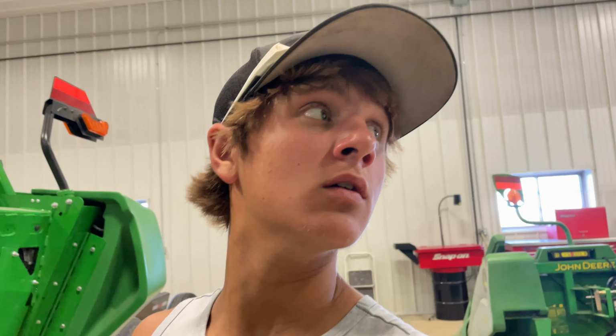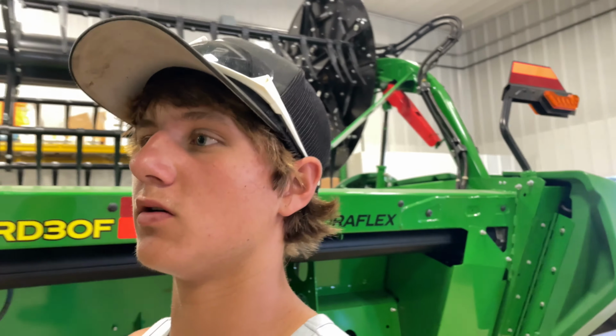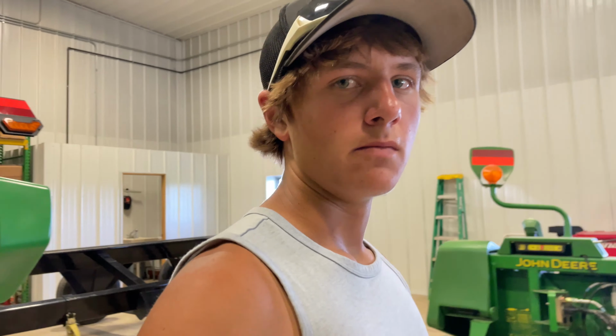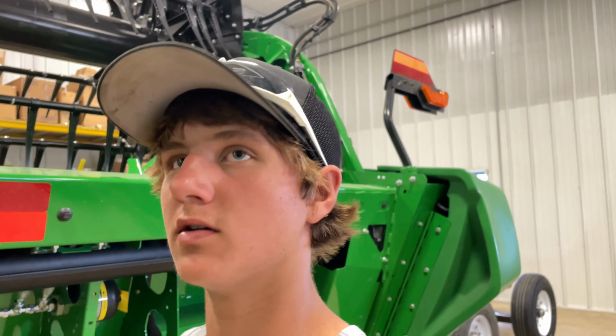And over the weekend, it's Monday now, but over the weekend we did all kinds of work to this. I know I'm filming the video of me changing the oil on it, but basically all we do is check all the belts, make sure they're not cracked or anything, change all the fuel filters, and then every 2 years we change the hydraulic filters. We actually ended up doing that this year. And then we ended up changing every single filter in this combine, all the cab filters, all the air filters, engine air filters, everything like that. And so yeah, that's all done. Check the tire pressures. And yeah, basically you just do general maintenance to it.